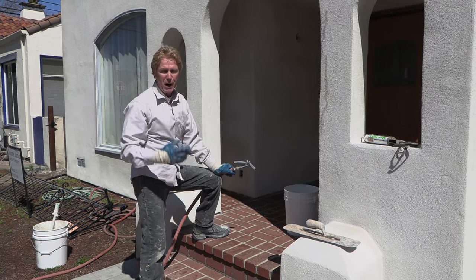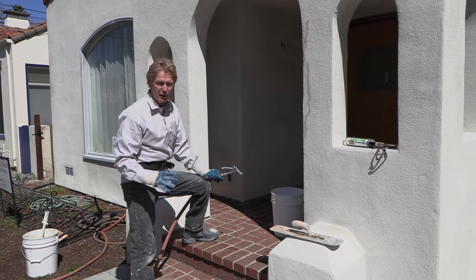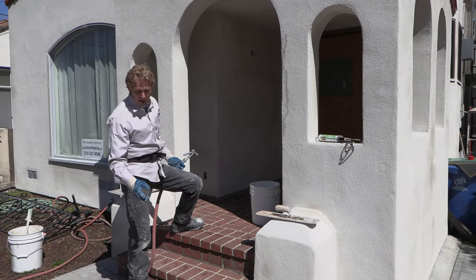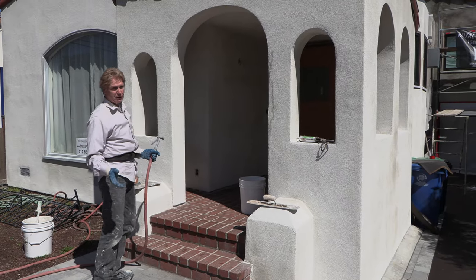If there's no dust, dirt, moss, or anything in it, that's how you know it's a brand new crack. All the rest of the cracks in here — it's typical, it's a 120-year-old house — but the new one here has no dust, dirt, or moss. That's how you know it's a brand new crack with tamping. It's a big machine again, it vibrates the ground, and that creates it.